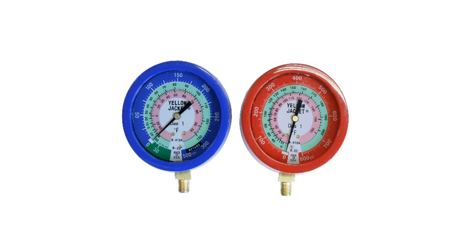The first one we'll take a look at is the R22. So you're going to connect your gauge up to the low side pressure port, and whatever that pressure might be, your needle is going to roll around. Let's say for example it falls right here at 100 psi. When the needle indicates 100 psi, it will fall across the inner temperature rings, and you'll notice at the point where it crosses the R22 temperature ring, it looks to be about 58 or 59 degrees.